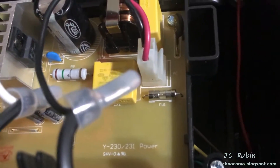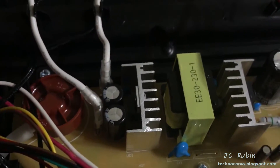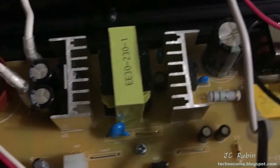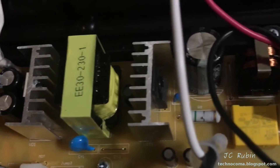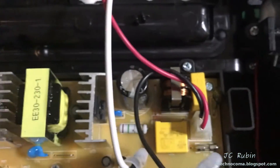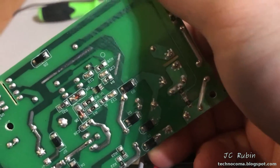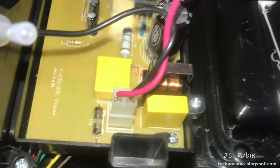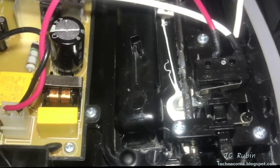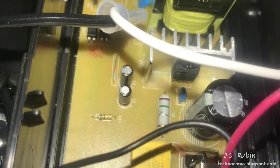Maybe an underrated fuse — that's all going to have to be tested. I note something strange: there is a conductive heat pad on this voltage regulator on VD1, but not one on VT1 — or maybe I just can't see it. That's the only interesting thing I note between those two. Other than that everything seems fine on the other side of the circuit board — nothing melted, nothing exploded. I measured both the switch and the fuse with the continuity meter on the voltmeter and both turned out to be good; neither of these is the problem.